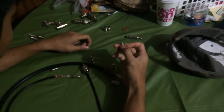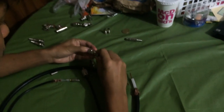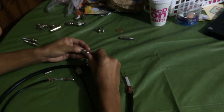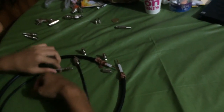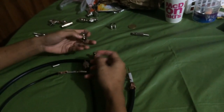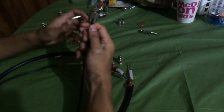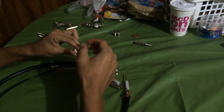What you do is get your reducer and connect it to your PL259. Just tighten it up so it tightens the grip on the RG58, making it really tight, secure, and flush. I've made one here as an example — I'll just show you that real quick.